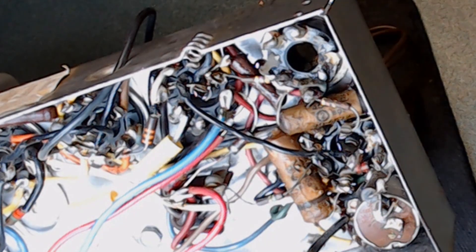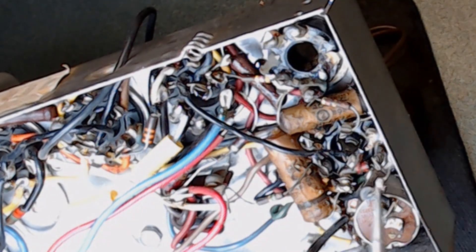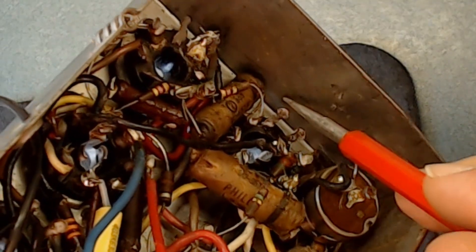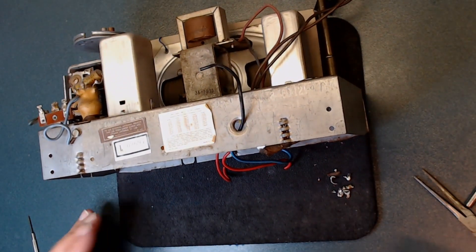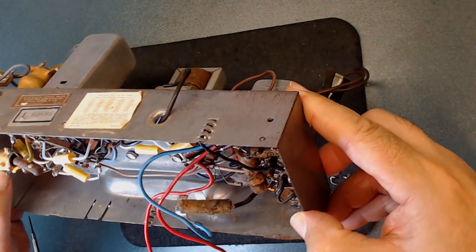There is so much stuff wrapping around it but there is nothing there — they kept cutting stuff off but didn't remove everything. This pin is full of junk. I think because they broke off this one, they just didn't want to take everything out and left it there. So I need to go over there and clean all this up. This capacitor goes there, this resistor goes there as well. Why they did it that way, I have no clue — unbelievable. So let me clean up all this mess; when you clean it you should be very careful not to break the two pins.